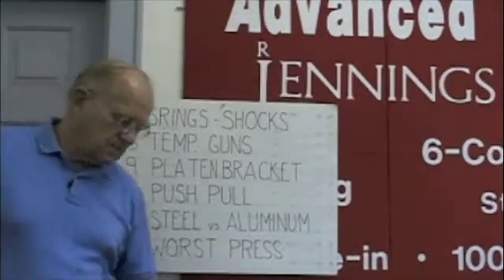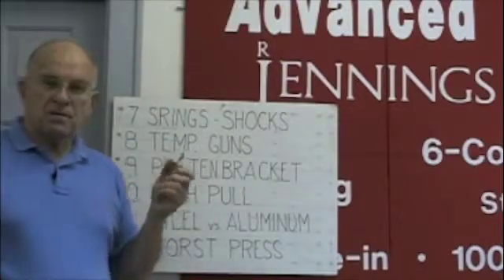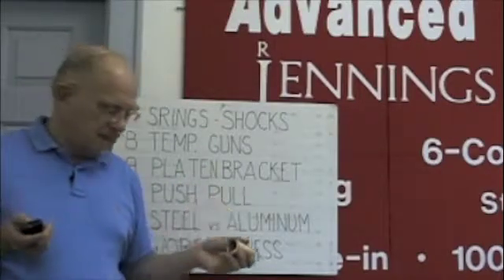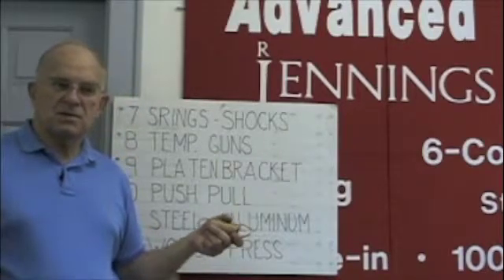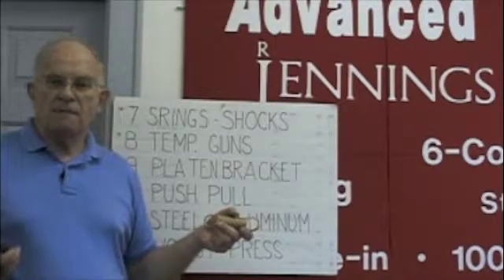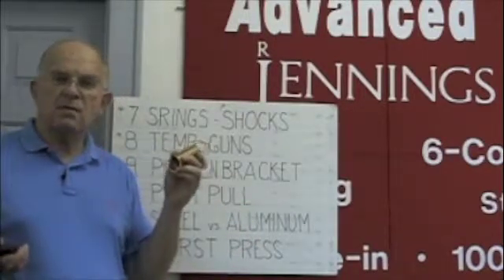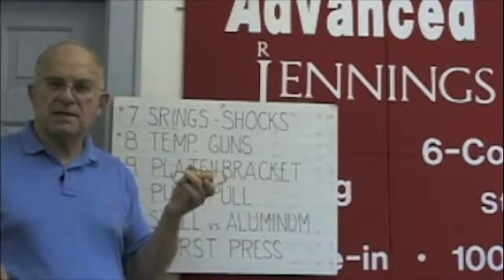What about springs? This in the spring industry is called music wire, and it has a certain spring rate — an ability to lift weight. However, many presses today have either side clamps, which is a really old-fashioned practice you should avoid, or they use castings, or worse, they're steel. In which case, the spring may not hold up the weight.